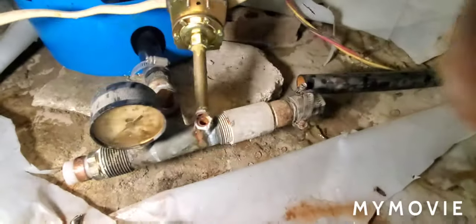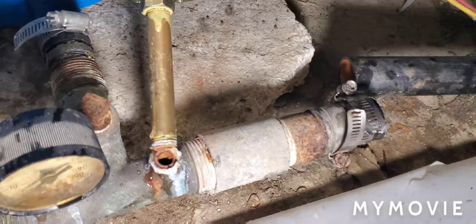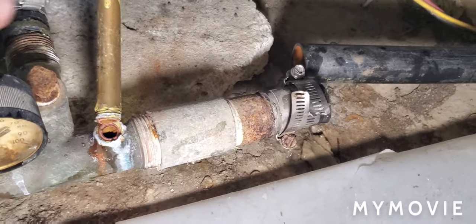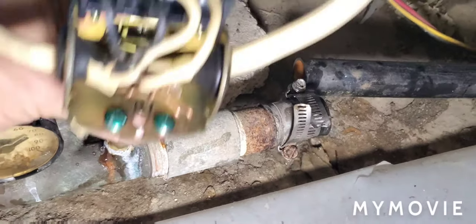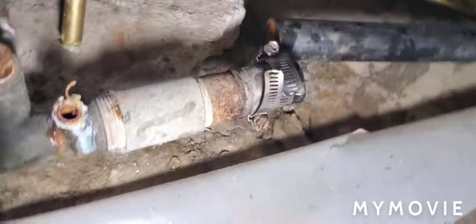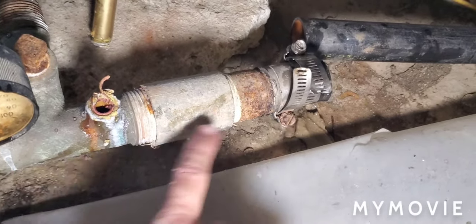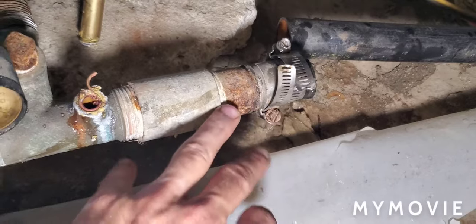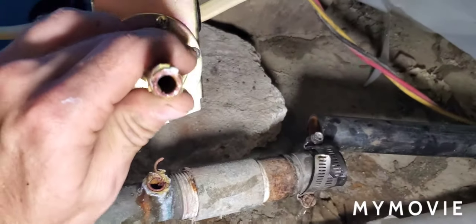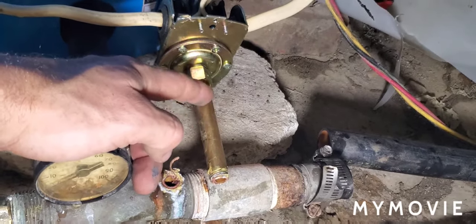That is wild. The reason why this happened is because the water itself is probably pretty acidic being that it's old. The brass completely dissolved and started to build corrosion. This fitting is galvanized and so is this one. When you connect galvanized and brass, you get galvanic corrosion, which can start stopping things up — like the inside of this hole can be stopped up with iron buildup, mineral buildup, whatever.